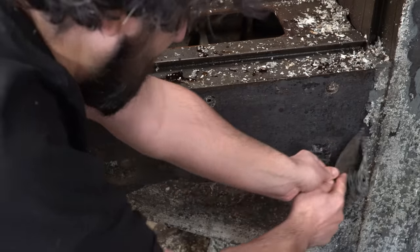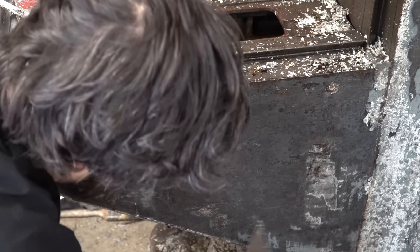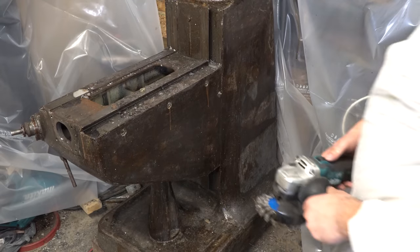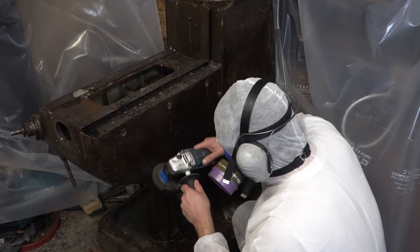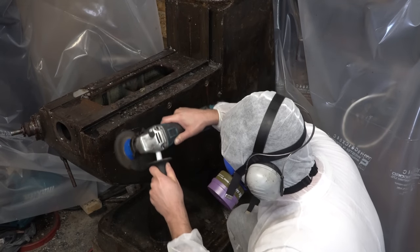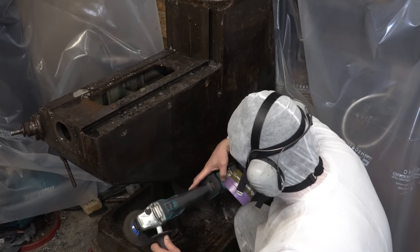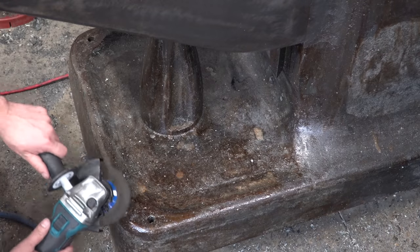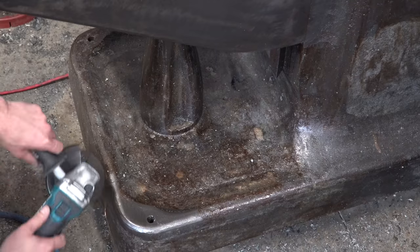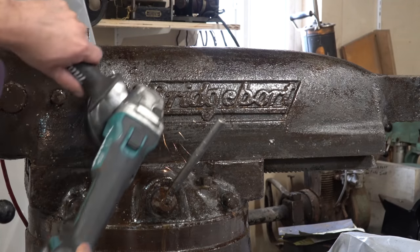Part of what I was interested in, in terms of removing all the paint off this Bridgeport, was seeing how much body filler was in your average Bridgeport — I've been told it's a massive amount, but I really wanted to see. I'm trying to be safe here — this is lead paint, and I have small children, so I just don't want to risk that. So I'll just suit up, wire wheel it all, and throw the suit out afterwards.